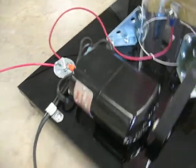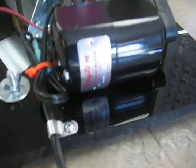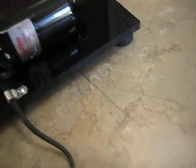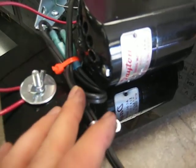That's how the bracket alignment works out. For connecting everything, the motor is connected on the bottom using some smaller metric screws, and there are spacers in there because you don't want the screws going too far into the motor. For the wire support, this is just a very small 5/8ths machine screw that holds a little aluminum wire holder, which bends over the wire connected to the motor. The plug is already going to be placed into the wiring system, so you won't have to wire it yourself.